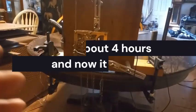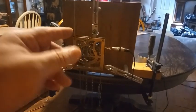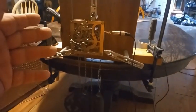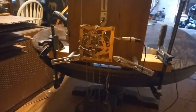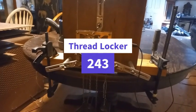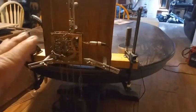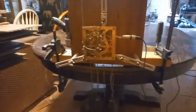In the last video, I also told you that the verge assembly moved on me. I got my thread lock in that I ordered and I put some thread lock on the bridge of this verge assembly — that's supposed to dry really well and be really strong, according to machinists I talked to. I brought it in here where I got the table set up with the beat amplifier on it. Sounds pretty good.